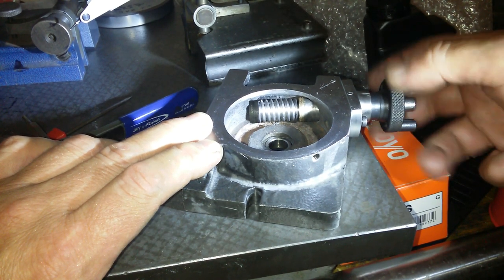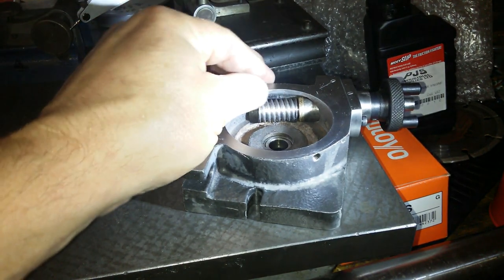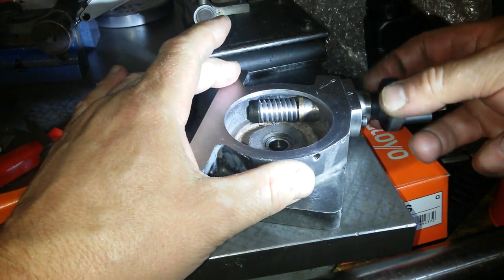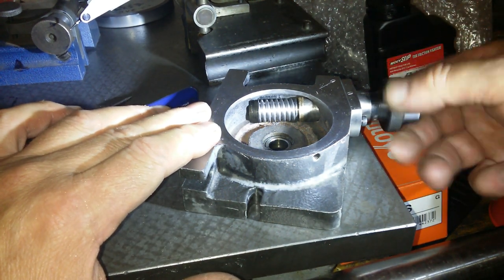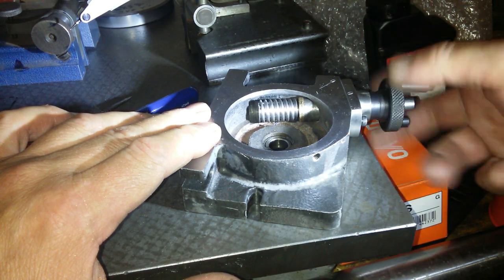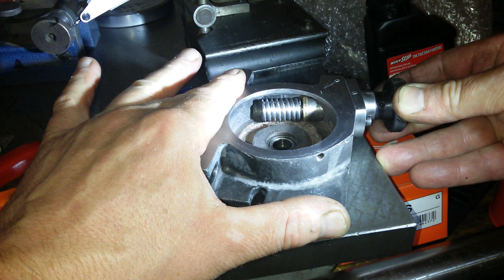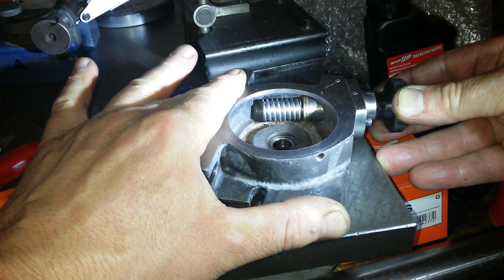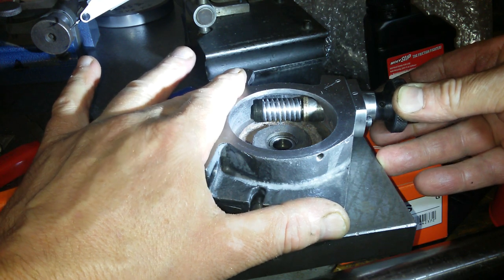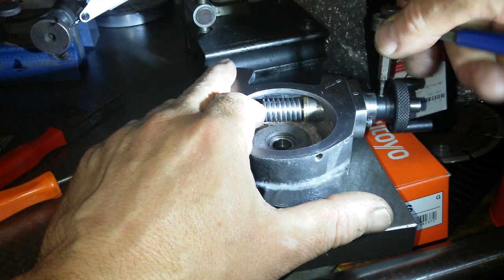But the problem we're having is the engagement place on the teeth is not right. It's grinding, it's too tight, there's no play. It is going to be knackered before too long. Well, that's beautiful now. So we've got a gnat's cock of end float. Take a bit of that out now. Excellent. Let's take a bit of that out.